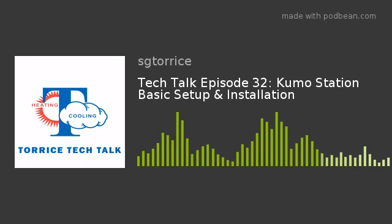If you need more info on that, we have the podcast posted on our iTunes stream, our website, and all over the place. Or you can call Ken, Phil, Russell, or Mark — they'll send you the podcast directly. We are installing the Kumo Station, model number PAC-WHS01HC-E. The Kumo Station contains four relays that allow third-party integration with backup heaters such as hot water baseboard, humidifiers, dehumidifiers, and ERVs. These relays have isolated dry contacts, with the exception of relays three and four, which can be changed to wet contacts outputting 24 volts — useful if you need 24 volts to energize a humidifier or ERV. For larger installations, you can install more than one Kumo Station, though you have to set the second station up as an additional site. One station usually handles most applications.